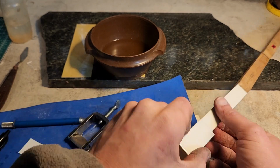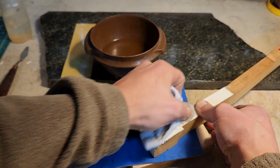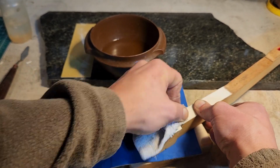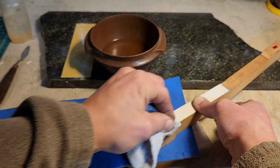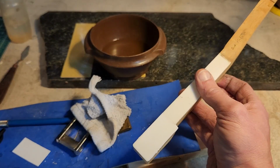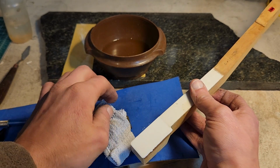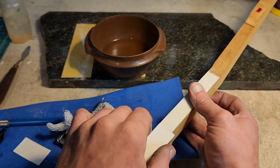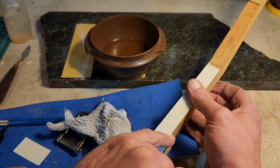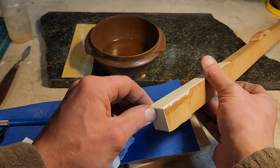This is the first one that I did, and while the process was a little intimidating, I was practicing on the piano at this point, it turned out really well. After drying, the key tops needed sanding, both between the old original piece, the tail in this case, and the new piece where there was a height difference, and then along the edges where there was some glue squeeze out and some overhang. And of course, around every corner, there's a new challenge waiting for me.